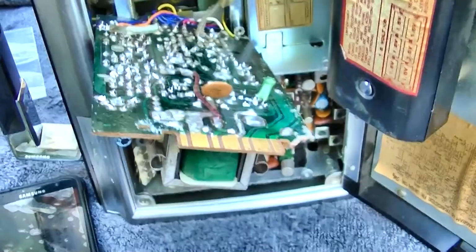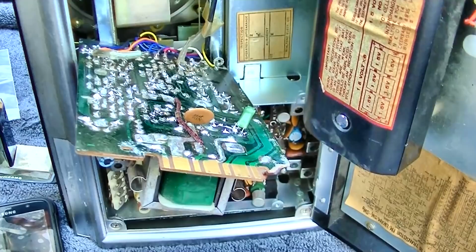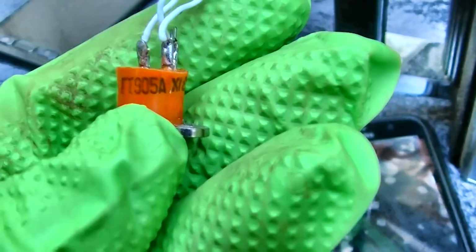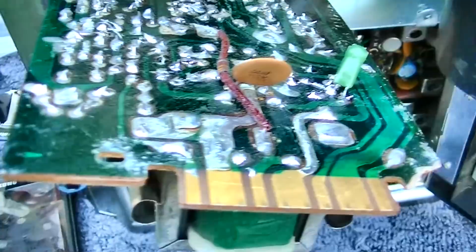I decided to go back with germaniums on this because I was thinking about the little IF test we did with the SDR radio, where the AM seemed to be really weak and the FM went hundreds of feet with just a wire on the collector of the third IF transistor. So what I've come up with is these Russian germanium transistors. Isn't this a cool package? Look at this. This is a GT905. This is like a 3 amp, 70 volt transistor, something like that. PNP germanium.